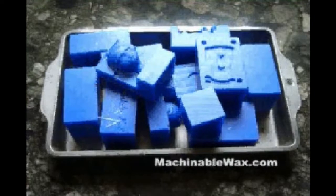There are two ways to cast machinable wax. For a small amount of wax, it's possible to place the material in a mold and heat the mold and wax together in an oven — this usually works best only if you're working with small pieces. The better way is to melt the wax in an oven and then pour the heated wax into the mold.